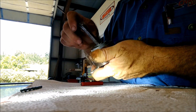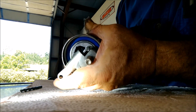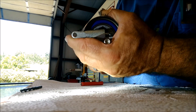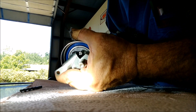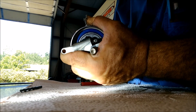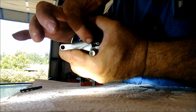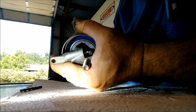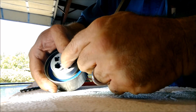After we went through and cycled and exercised it a few times very slowly, we've gotten to where the tension comes off. If I let it sit for a while, it'll get rock hard again. If you can see that piston going back in, that's what you're trying to compress. Now that it's been exercised, it's very easy to move. Once it sits out and the fluid refills the cylinder, it's just going to get stiffer and stiffer — and that's the resistance you keep feeling and why people are breaking this section here.